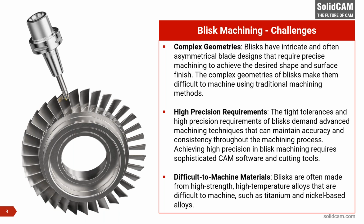And let's not forget, especially when it comes to using barrel tools or circle end mills, the machine also plays a very, very critical role in the movement. So if you have an old machine which is not willing to move smoothly, then you have problems using barrel tools on such machines. So the machine also plays a super critical role in this entire process.